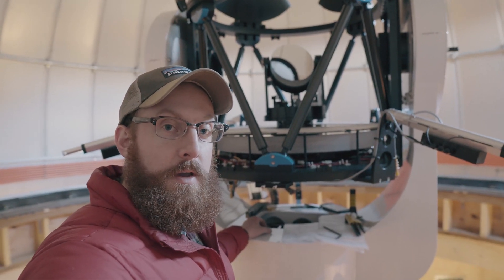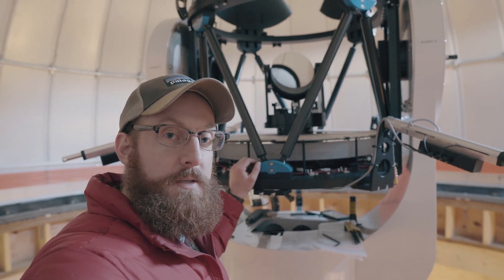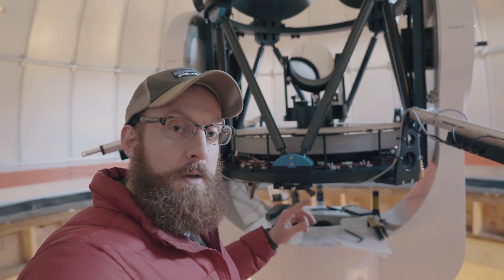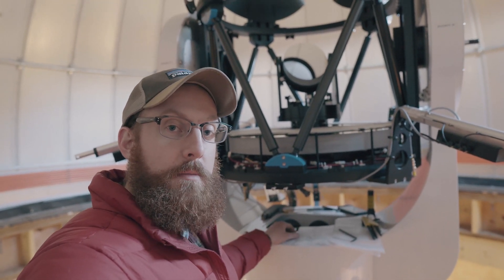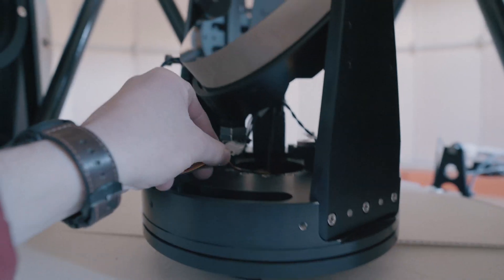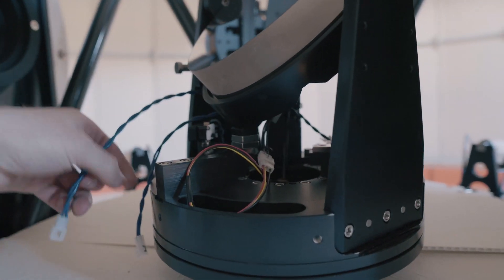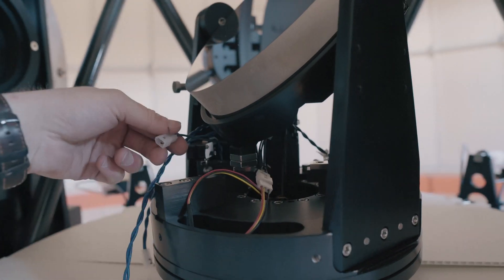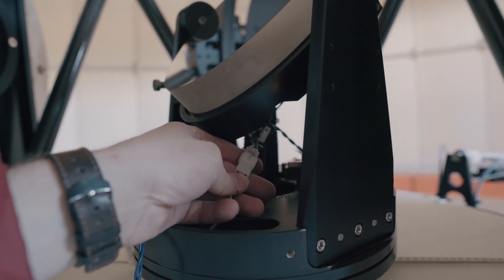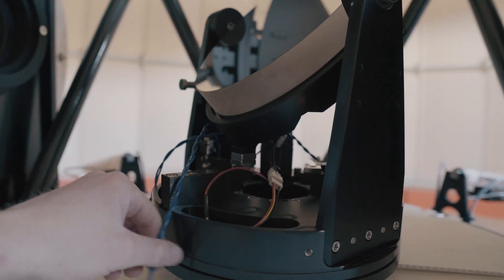I got the baffle off of M3 — it helps having two people to shimmy it up over the system. I'm going to remove the electronics below. There are three bolts holding M3 in place — I'm going to remove those and lift out M3. We have three cables: motor one, motor two, 12-volt for the dew heater, plus the temperature sensor data Molex connector. I loosen the bolts and now I'm ready to lift M3 out.